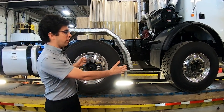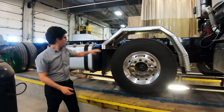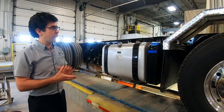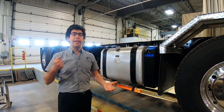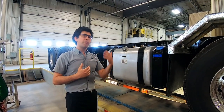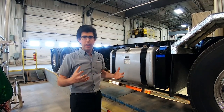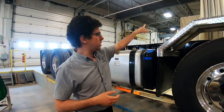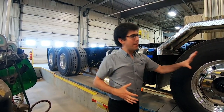It's a 74-inch front spread, so in order to leave some room we have to relocate things behind our second steer axle. We removed and relocated the DEF tank and fuel tank. Most of the different equipment on the chassis can be moved around — ask us and, through collaboration with dealers, OEMs, and installers, we find the best position to ensure upstream planning. The battery box, air dryer, and fuel filter were also moved back to leave room for the AMS40T2.